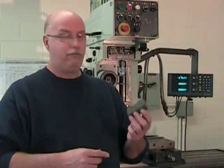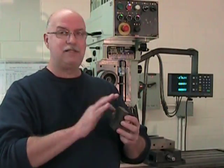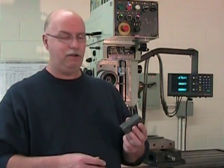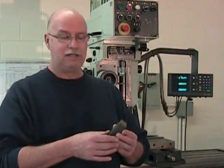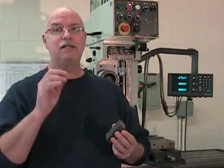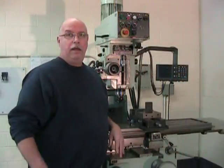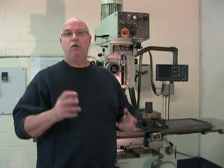The hot rolled 4140 block, however, is a whole other can of beans, because it has 6 surfaces that are rough and not accurate. And that means that we're going to have to machine each one of the surfaces. And to manage to get this quite inaccurate block good and square, well, we're going to have to follow a very precise sequence of operations. And remember, square doesn't happen by chance. You have to purposely square up a part.